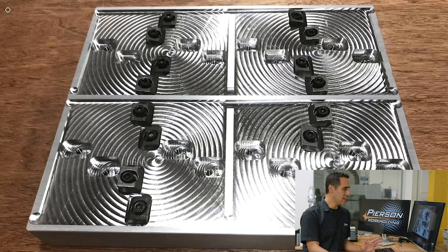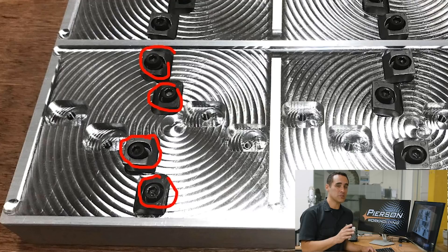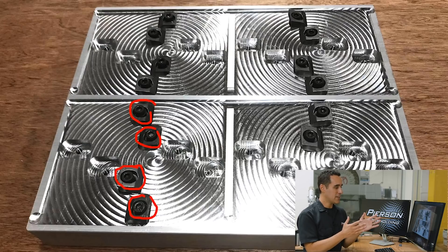Here is the pallet and it has pitbull clamps set up. What I like about this is Jacob has used pitbull clamps facing one direction and then he's sharing a pocket and using pitbull clamps facing the other way. That falls in line with our guidelines of not using a slot but instead putting your clamps in pockets. Because his clamps are right next to each other, he's not losing a lot of real estate on the pallet. They're offset just a little bit, which is fine — it worked out for his fixture.